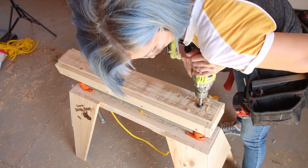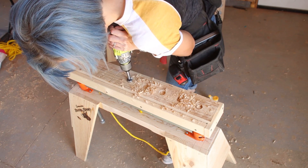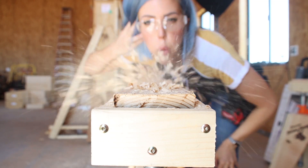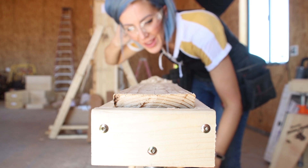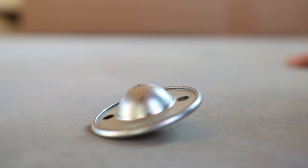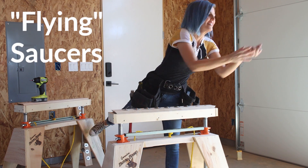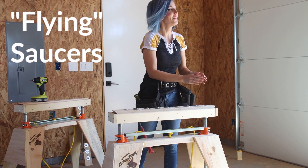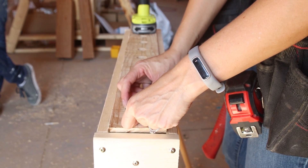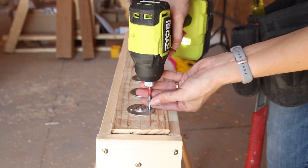On the next insert board, I marked the center lengthwise and began using a Forstner bit to drill 7/8-inch diameter holes. These are for 5/8-inch diameter steel ball bearing casters — really cool because unlike most casters they can seamlessly spin 360 degrees. I left a link in the description for the ones I used.